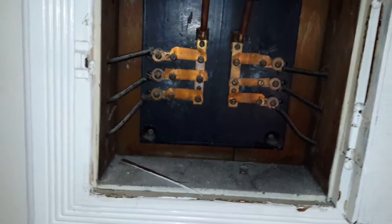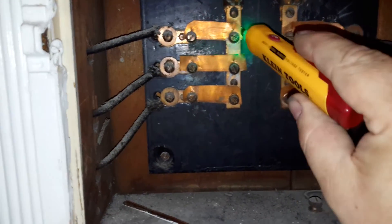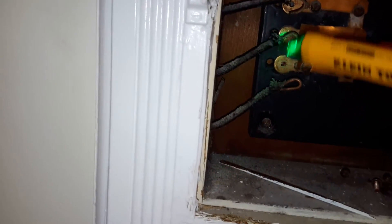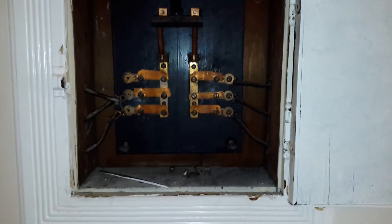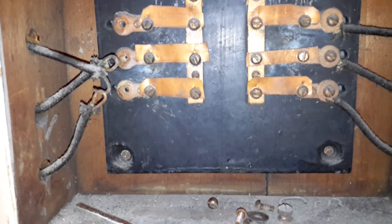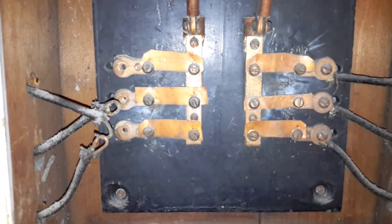This is my last attempt from upstairs to pick up circuits. This is the old fuse box from the original service. I know these are the hots and these are the whites because I tested them. I'm going to disconnect these three, find out which one is the hot and which two are the circuits, and turn the electric back on. Of course it was number four — these two are circuits and that one is hot. After looking at this, it's not going to help us at all. Even when I disconnect the circuits and re-hook them up, they're still all mixed up between first and second floor. So it was worth trying, but there's still no clean break between first and second floor.